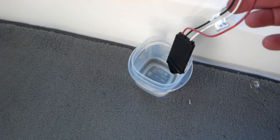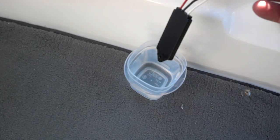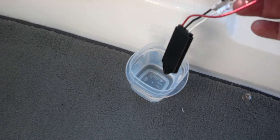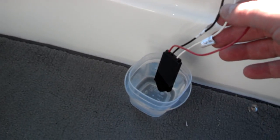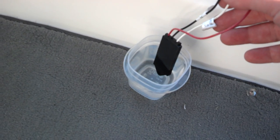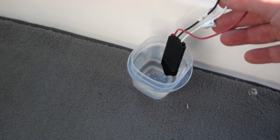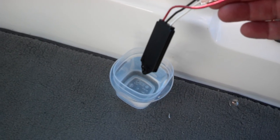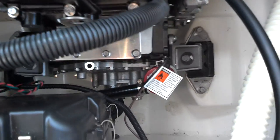We remove the sensor and in a few seconds we're back to normal. Drop it in the water again — only the bottom half of the sensor has to be in the water. We get our tone, take it out of the water, and we're good to go. We're now going to install this along the side of the bilge pump.